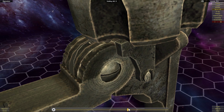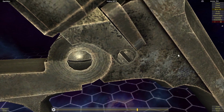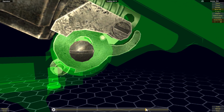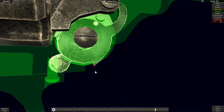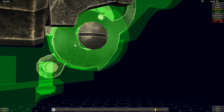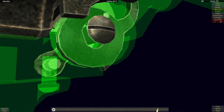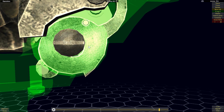And then when the frame starts to go back closed, it's this squeeze in between this arm and the frame that gets the disc to spin back around so that it can fall back in place. And then once the tooth goes beyond the lower frame here, that arm is going to push out, bringing the tooth back down. So you can see the arm coming out just as the tooth comes down, and then the disc lowers down into its lowermost position so that when we open the action again, that tooth will catch the lower part of the frame.